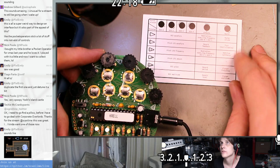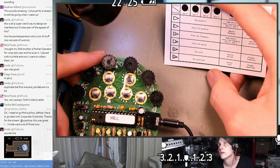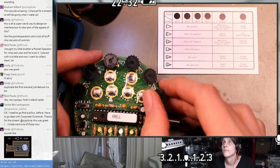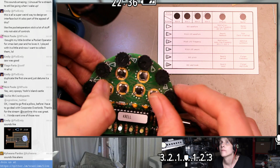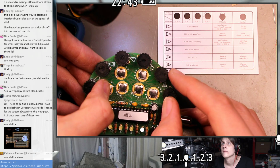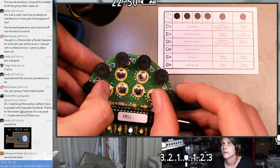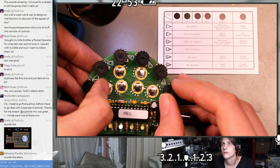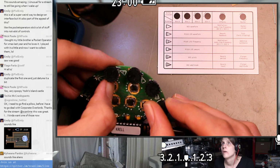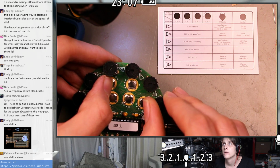Okay, how does this work? So let's just try the volume controls for each DCO. That would be after releasing the DCO button, controlling, not master volume. Oh, DCO amplitude, this one. Is this only using DCO 0, or is it modulating everything with that? Because I think I'm turning that volume down and then it's quiet. Oh, I think this is modulating DCO 1 with DCO 0.